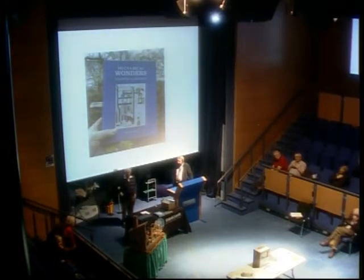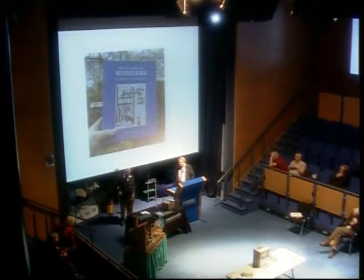I've been interested in this business of engine speed because most beam engines at the time are typically only doing, say, 11, 12 strokes a minute. I was very surprised to learn that Murdoch's bell crank engine, first developed in about 1798, actually ran at 40 RPM. So it's interesting that Trevithick was using a lower speed, and I wonder why, because if a Murdoch engine can run at 40, quite successfully at the time, then certainly a Trevithick engine could have. So that's an interesting difference. We must talk further about this.